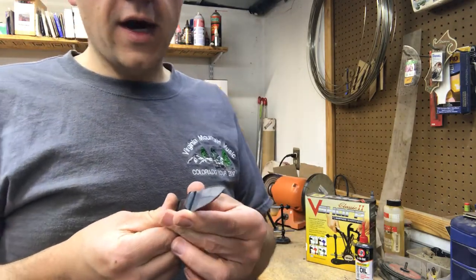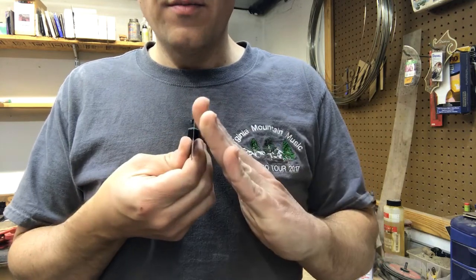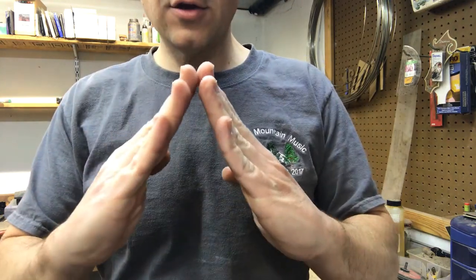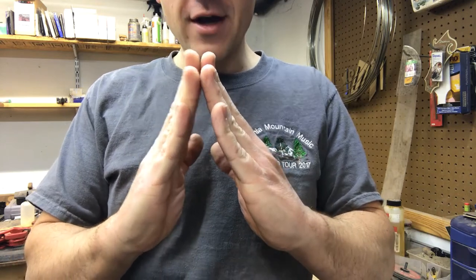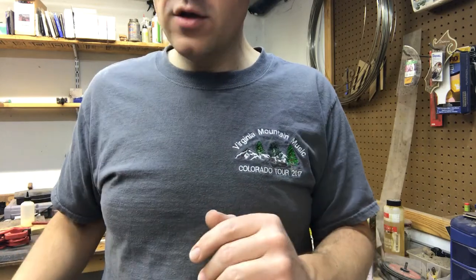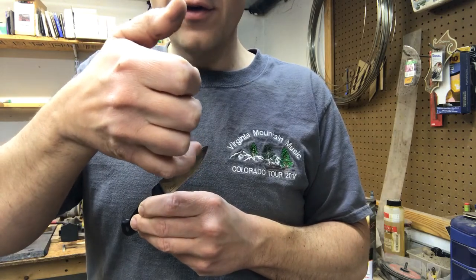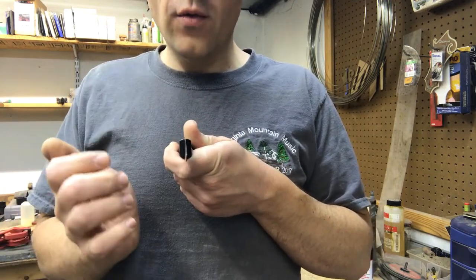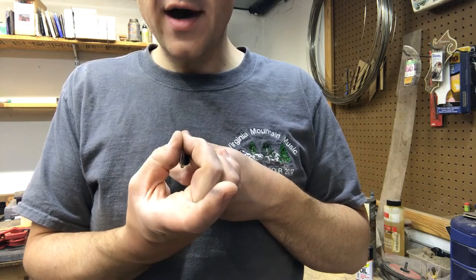When sharpening a knife, all you're trying to do is bring two points together perfectly. You're just wanting to make that edge come together exactly — in theory that's simple, but in reality it's kind of hard. Usually when you sharpen you'll start rolling one side over a little bit more, and they call that a wire edge. You can feel it by running your pinky nail up the side of the blade and feeling your nail hang on that little lip.